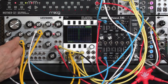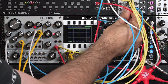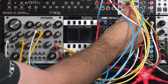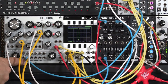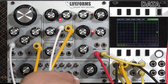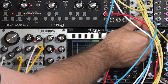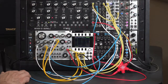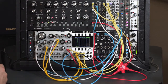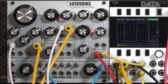I could turn this up all the way to 100% — I've now gone beyond 100% width. The pulse width, as I mentioned before, is very touchy: it only needs plus or minus 2 volts or so to go plus or minus 90%. I'll turn that back down to zero for now. Finally, I can use external signals such as envelopes to replace the internal LFO being routed through the B bus. Overriding the input for these modulation buses comes in particularly handy when we're controlling the contour section.